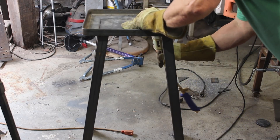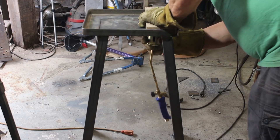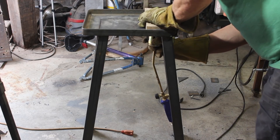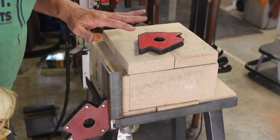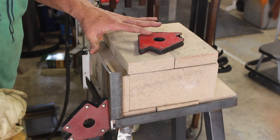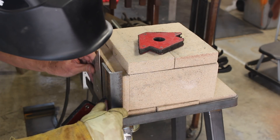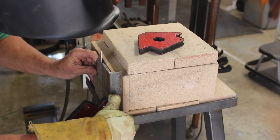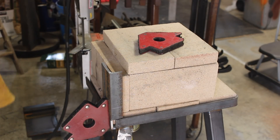Here I've fit the torch into the floor of the unit and all it needs is a little cross piece installed to tie the handle to, and I'll weld that in later. Now I've got to make a framework to kind of hold all these bricks in place. We'll just square the corner here, tack it in place, and then move on to the next corner.